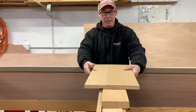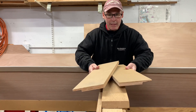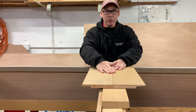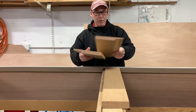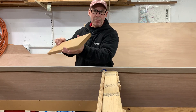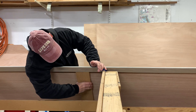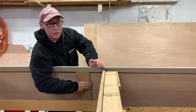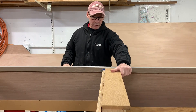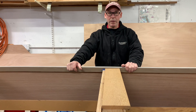You don't even have to do the shiplap. Another way, which I've used in the past and works great, is just take two sheets, put a block behind there, and just glue and screw that all together. That stiffens up the whole seam right across and you're good to go. You can also do the same thing on the sides — this already has a bevel cut on it, a 4-to-1, to join those two sheets on the side. That piece of wood fits right underneath the chine and that's how you join the sides together. No scarf joints at all — very simple, works good. When you're done, run a piece of fiberglass tape on the outside and you'll never see that seam. Fair that in, paint it, good to go.